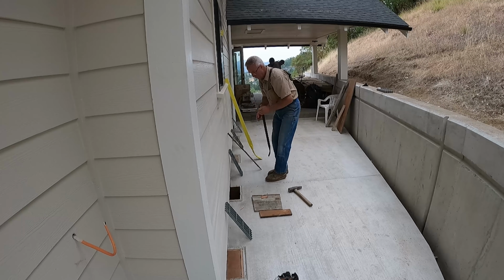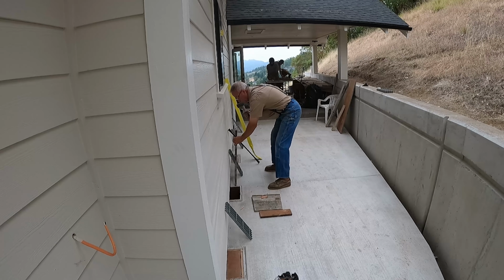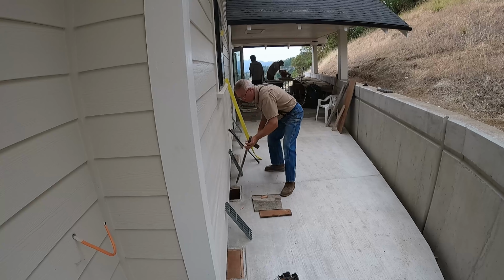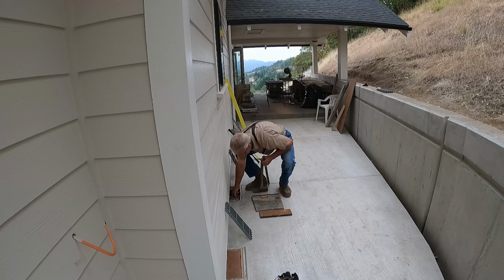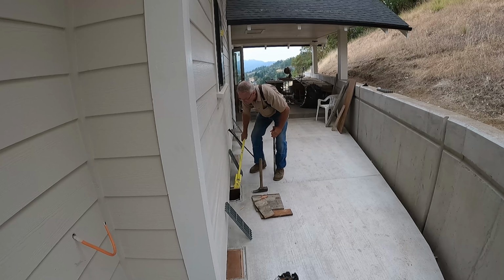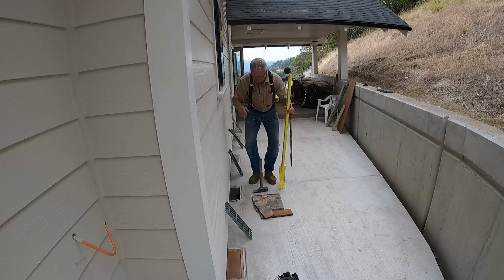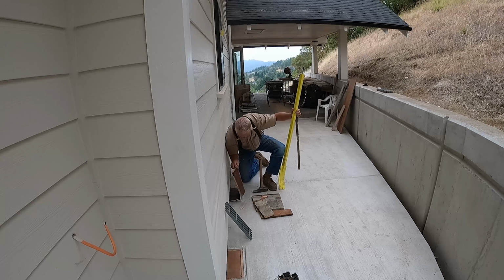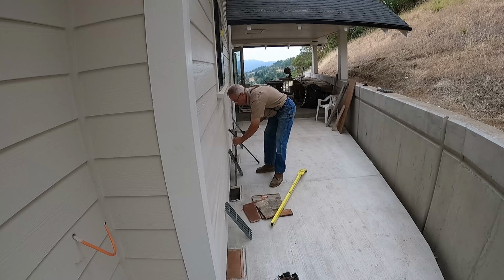These little vent well forms were put in a long time ago. It's really easy to build a form in a situation like this that just can't be pulled back out. So for these, each piece is tapered all the way to the bottom. The edges are beveled a little bit, and I just used my brad nailer to put them together. Concrete forms have got to be just a little bit tougher than they need to be, but not tougher than you are.